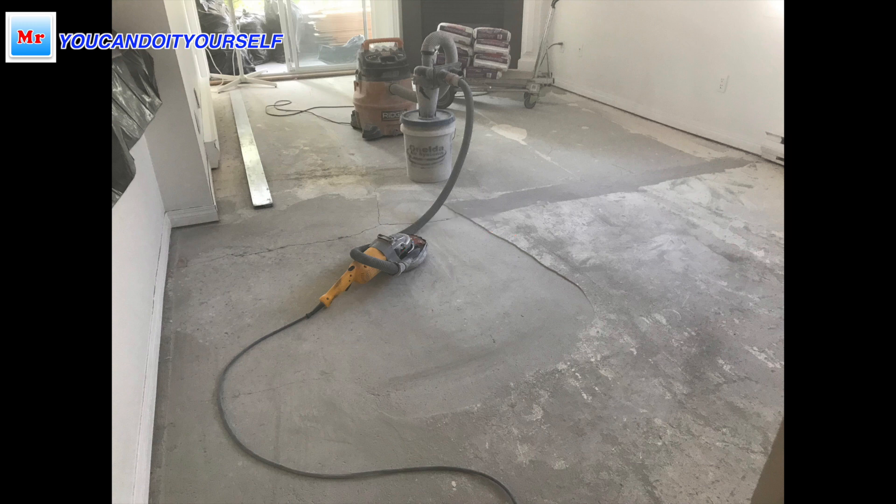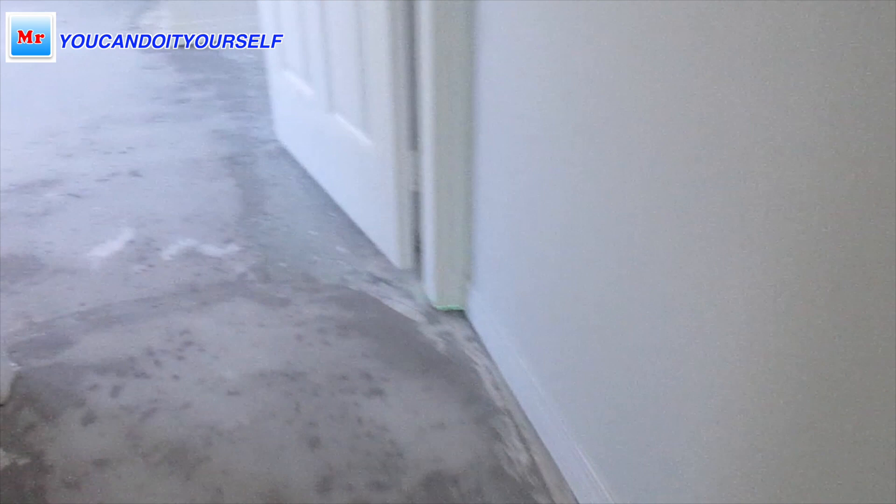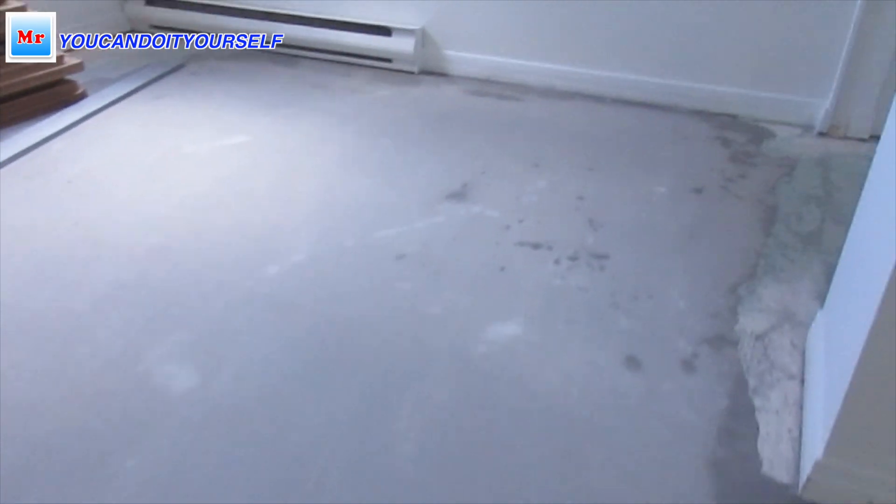The right side of this room was flat, but after this crack — you see it on the middle of the room — it's sloping down too much. For minimizing this hump I just grind it down as much as I can, then level with a straight edge. I fill up this crack and just make it flat everywhere. This side to the doorway is sloping down too, so I make it flat here, and this spot I make it flat too.